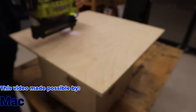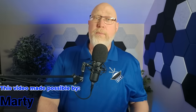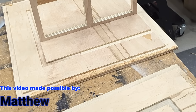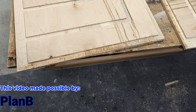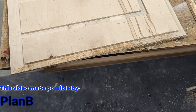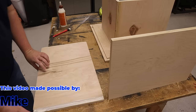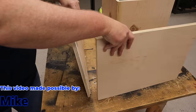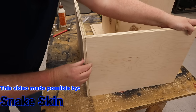Here I've got everything flipped over and I'm driving nails into what will be the bottom of the enclosure. Here's the downside of that downcut bit — it left some rough edges and caused some splintering. What you want to do here is just fill in those gaps with wood glue and sawdust, and then sand it flat. During the assembly process, all of the extra effort to cut those rabbets really pays off. Typically you need to grab a bunch of clamps as extra hands, but all of the parts line up perfectly thanks to the CNC grooves. This probably cuts the assembly time in half.